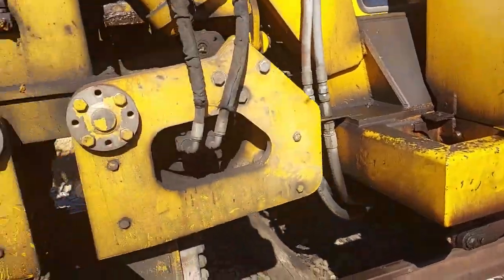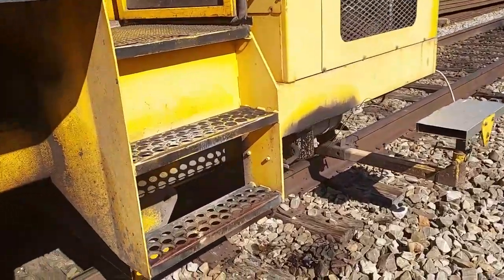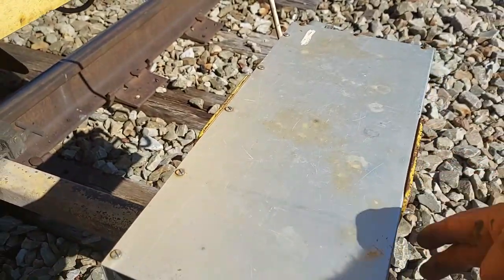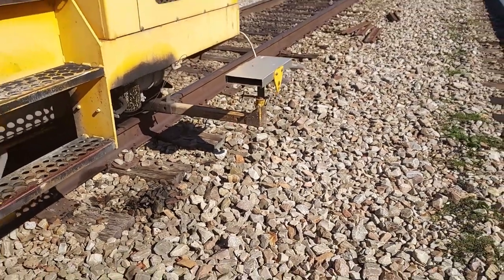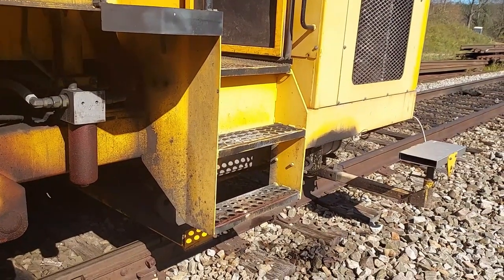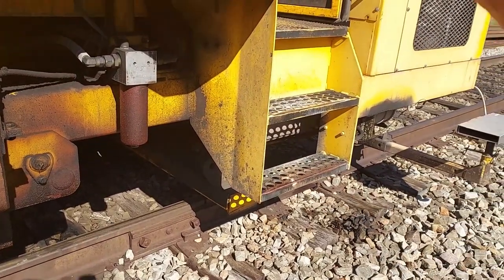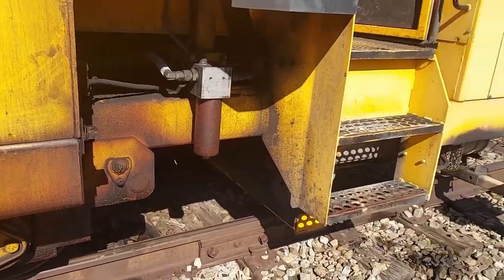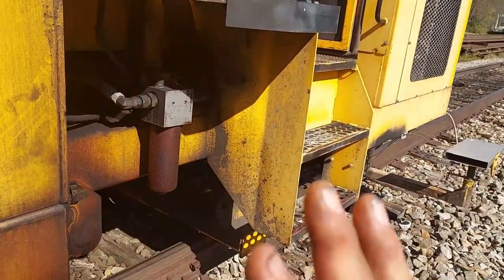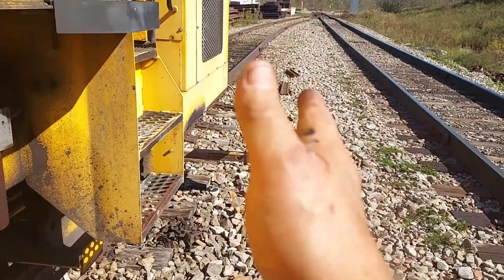You see why it's important that all this be referenced on the same rail. My lining beam goes back into this receiver, and back there there's a bank of photo cells — little photo cells about the size of my little finger, all spaced across there in two rows. If the lining light shows up on one side of that receiver, the machine is going to want to take the rail when it clamps it and push it over until that lining light gets directly in the center, and that's at zero voltage.